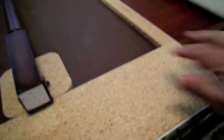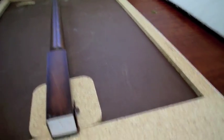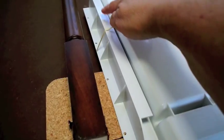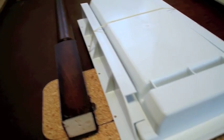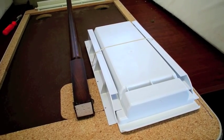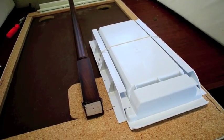I've got the tabletop lowered and I'm going to mark underneath where the table fits over on top of the benches so that I can make sure on both sides that I leave enough clearance for this to actually go back down again. That's probably the main thing you've got to look out for when installing these. One issue that complicates things is this lip here on three sides but not on the back. I'm going to have to extend a block back a little ways to connect to the screws there, so I'll have to make a block and glue it to the underside. This is going to take a little longer than I thought — originally thinking it was a 30-second project, but things turned out more complex and I'll likely end up making a trip to the hardware store too.